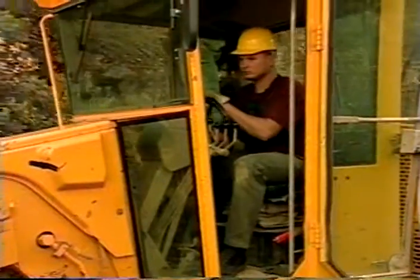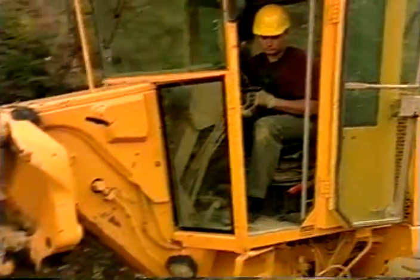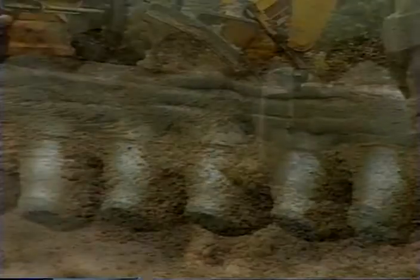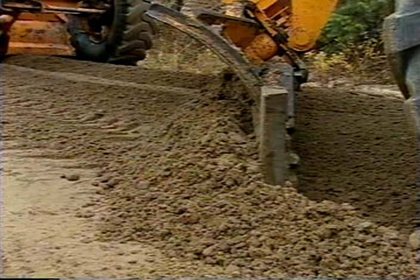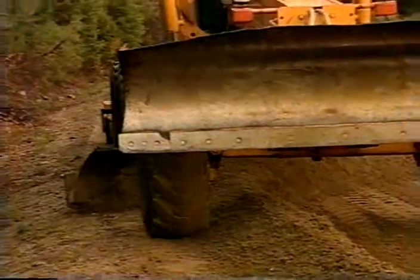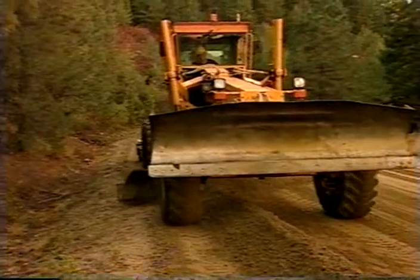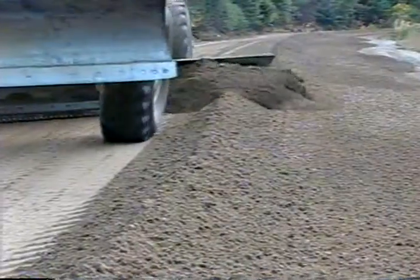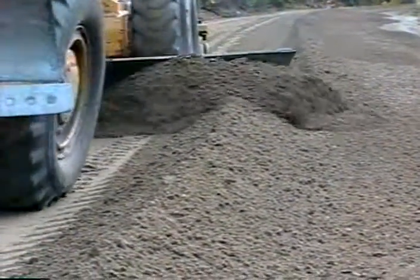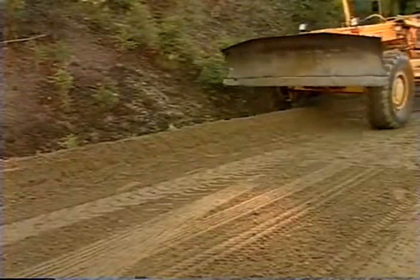Now begin the layout process. Normally, you'll need to adjust the mold board position so that it tilts fully forward. However, if your grader is equipped with a carbide bit system, it must remain in the vertical position in accordance with the manufacturer's recommendations. Lay out half of the mixed surface material on the ditch side of the road, spreading it in an even mat following the established road template. As you do this, place the remainder of the material in a windrow just across the crown. Depending on the width of the road, this may require multiple passes.